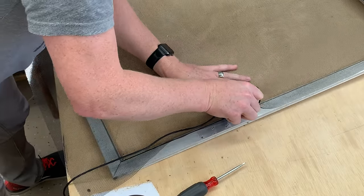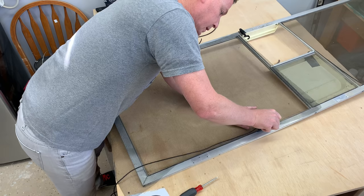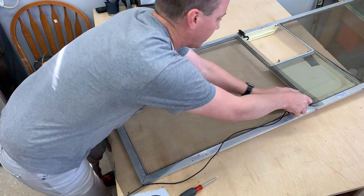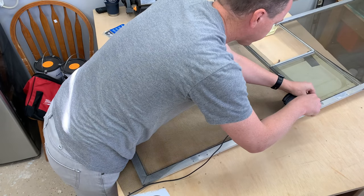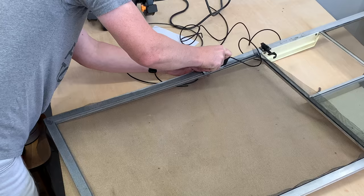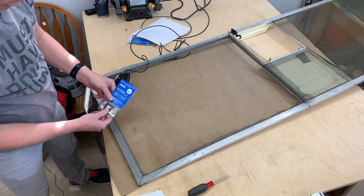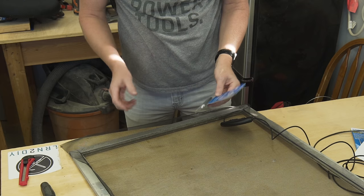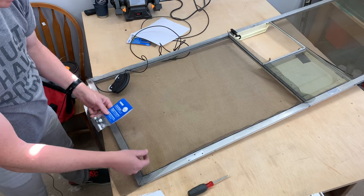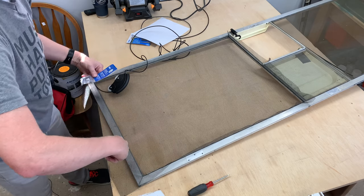If it starts to come out, just readjust. Basically you're riding this one-handed along the groove and it should give you a pretty nice fit. When I get to a corner, I'm just going to use the screwdriver to continue doing the same thing and push it in. Now, as I do this bottom piece — if you've got window tabs that are fragile and broken, these little window tabs are often just brittle and snap right off. You can buy corner springs and pull tabs and just put those in — they go right under the spline. You'd lay one right here and one right here, then run the spline right over them. Those tabs sit in and allow you to pull the frame of the window out when you need to.